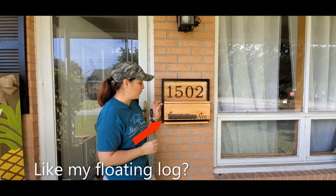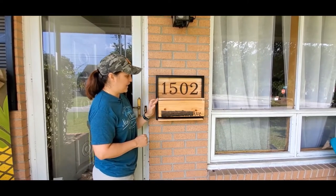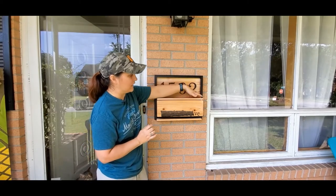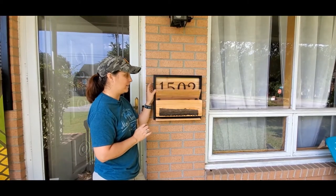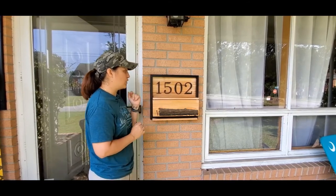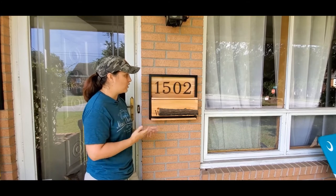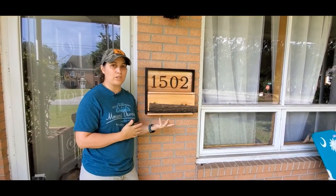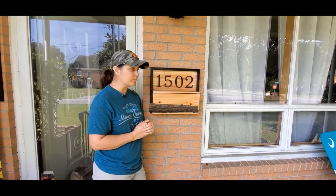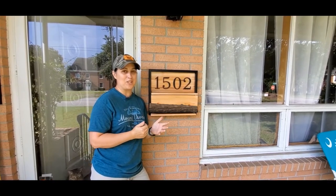Here it is — I think it turned out pretty cool! I added a shelf down here for outgoing mail and rubber stoppers to the lid so it doesn't bang shut. I also had to taper the back of the lid a bit more so it opens wider than I originally had it. I left the cedar planking its natural color and just polyurethaned it, then painted the border black to match the shutters. I added our street name and mounted it on the wall and it looks perfect. I'm very happy with how this scrap wood project turned out. If you'd like to try it yourself, just play around with your wood and see what you can come up with. Hope you enjoyed the video — please like, share, subscribe, and comment if you have any questions!